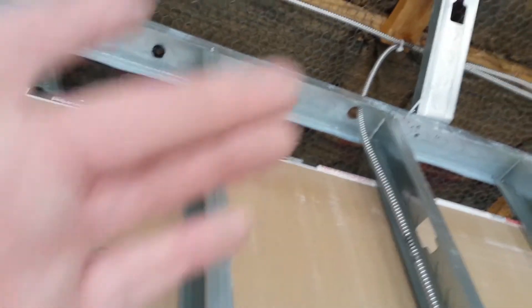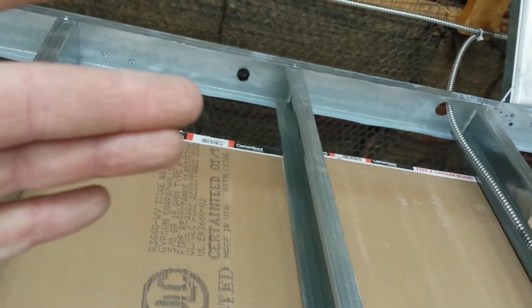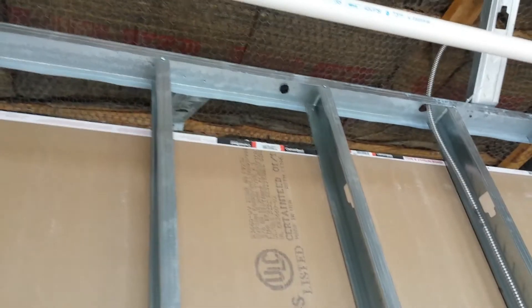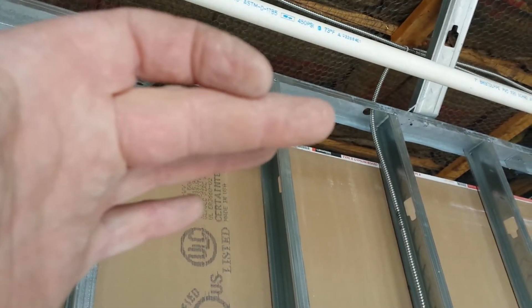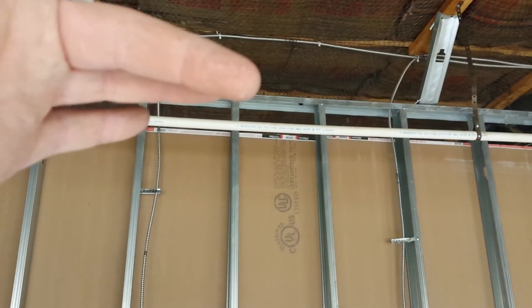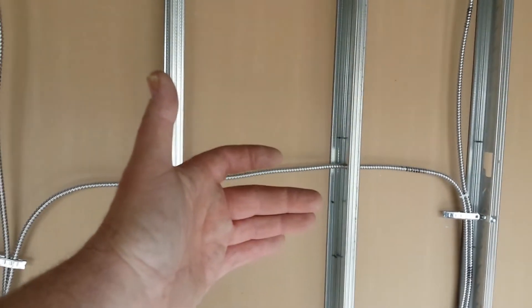Up at the top you'll notice sometimes you'll have what's called a grommet — way up there is a black ring. You drill down and put it in there, and sometimes they call them bushings. That way it doesn't strip the wire when we pull it down, because if it's just naked raw sheet metal it's going to really shred your jacket. For new construction you're going to have grommets — Arlington makes great little grommets. You can get a specialized bit from Klein at Home Depot for around thirty to forty bucks that is the same width to bring the cable through and hold the strap in there.